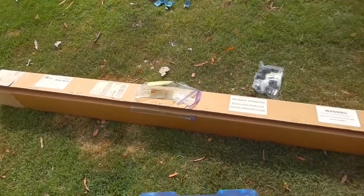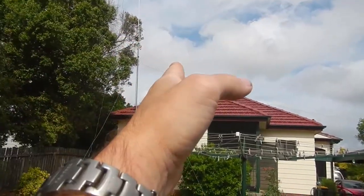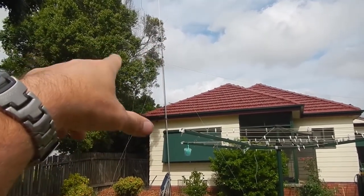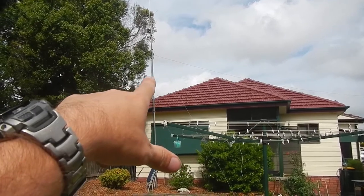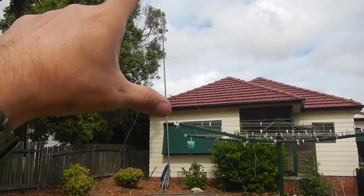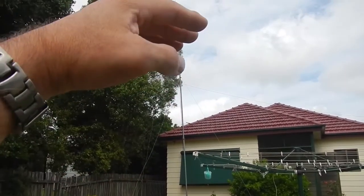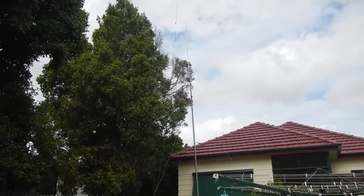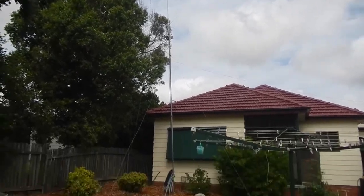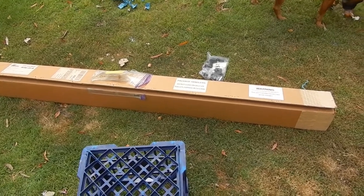While we're in the process of putting this up, it's just going to go on the 30-foot mast over there, coming away from the tree a little bit, probably closer to the rear of the house in the middle. We'll put it there so it gives me free space to rotate the antenna. The G450 Yaesu rotator is going to go up the top, then we're going to have a 270 Yagi — horizontal for SSB work — and then the tri-bander on top of that. That's the plan. We'll film it as we go, and if I have any particular challenges setting it up or tuning it, I'll bring you in.